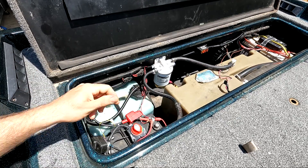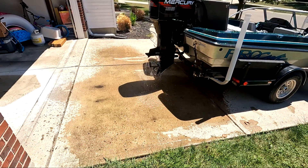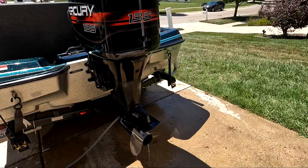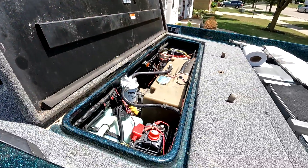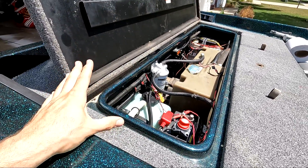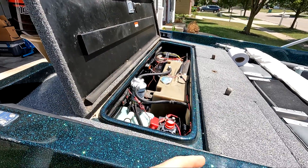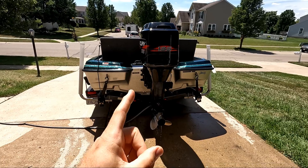You can see the fuel is starting to fill up in the bowl — that's really good. At this point I am completely happy with how this is working. It is 100% functional, we have no leaks in the fuel system, and the outboard is running beautifully. Now I just have to wait and see if any water makes its way to the bottom of the fuel bowl. My guess is that once we're on the water, maybe a little more level on the fuel tank and picking up some deeper gas, that's when we'll start seeing the water — or it may just take time to separate. For now, everything looks good and no leaks. This is how you install a fuel water separator. If you found this helpful, hit that like button, subscribe for more boating and outdoor content, and thanks for watching.